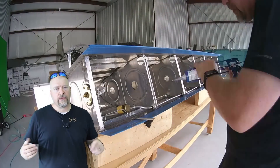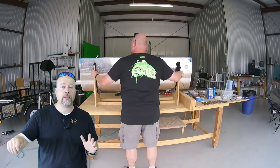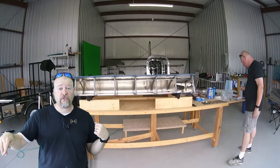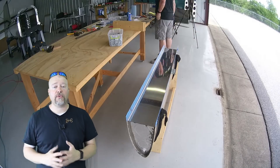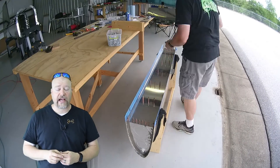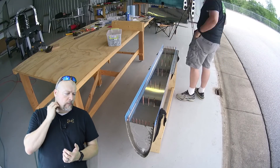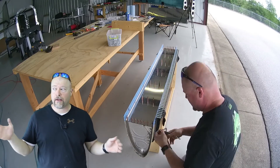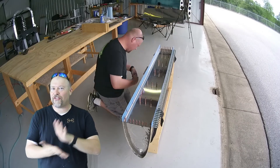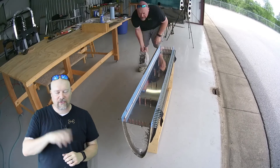What I did — similar to the internal structures — I put down the bead of ProSeal and smeared it along using a popsicle stick. The inside was prepared beforehand: I put down blue painter's tape to cover areas where I didn't want ProSeal, then scarred it all up using Scotch-Brite pads. Once you smear it out with the popsicle stick, get all your stuff ready. Don't forget to have all the rivets and things you need — I had to go hunt down some pop rivets for the Z-connectors because I forgot them.